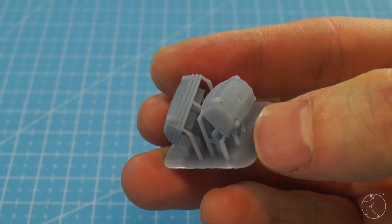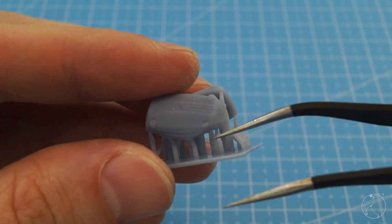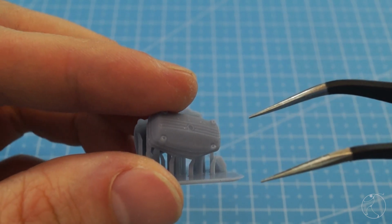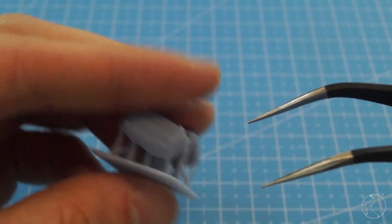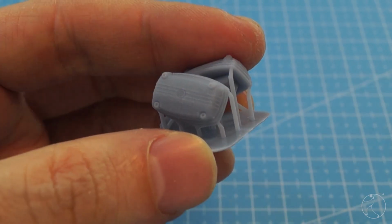Here, one of the valve covers decided not to be printed. There was a separation of the support, and the corner is missing. Maybe there was a spot on the FEP film in this place. As you can see, everything is in perfect order with the other lid.